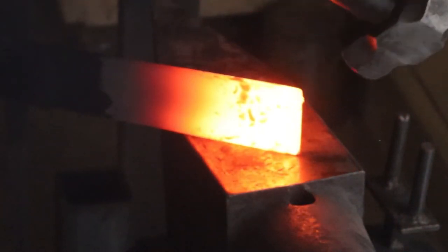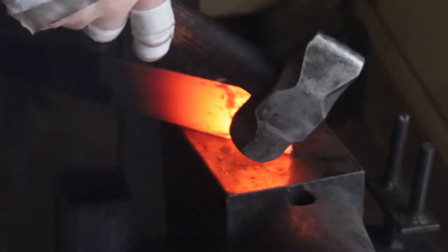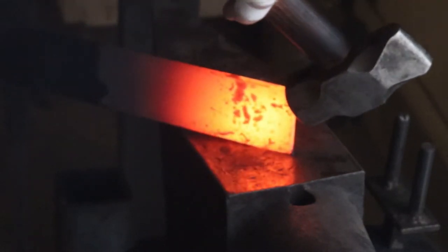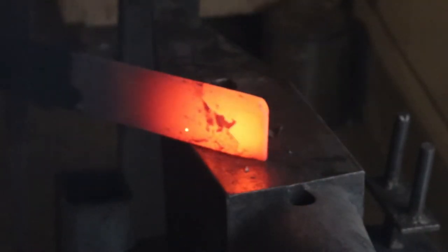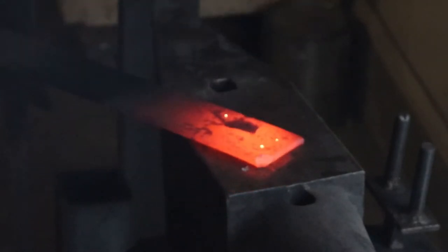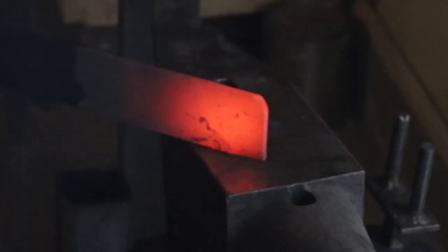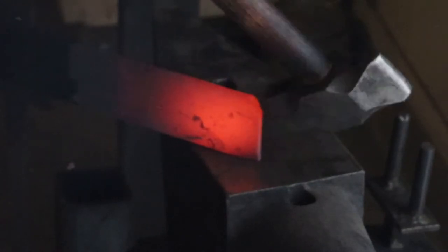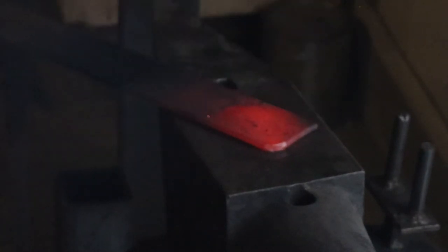First step: I'm going to start forging in the tip. We're going to do this by setting it flat on the anvil and hitting it on the corner at a 45 degree angle. You don't actually want to forge this down — you want to forge it back into itself, called upsetting. It helps to tip it up just a bit and come down like this. Once it starts to mushroom out on the sides, take it flat and flatten it back out. The whole goal here is to avoid getting a fold where you get a crease in the metal.